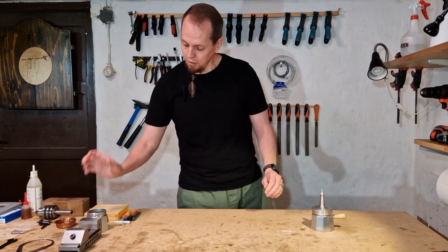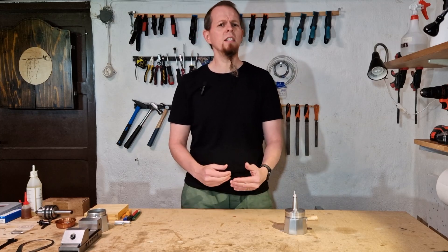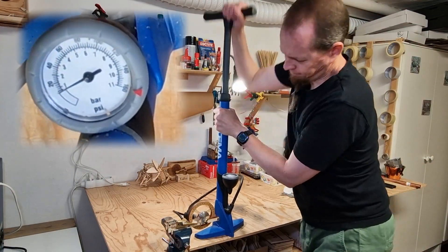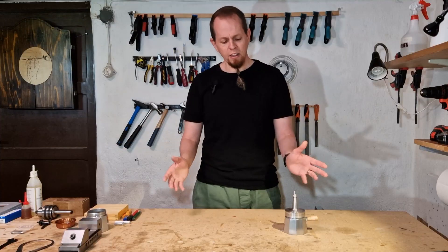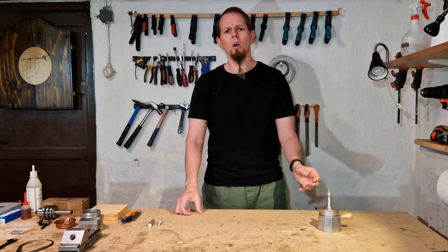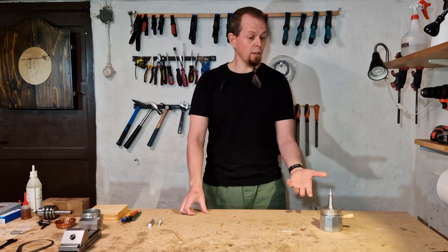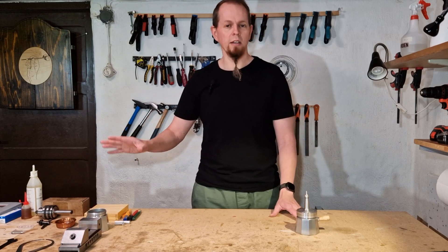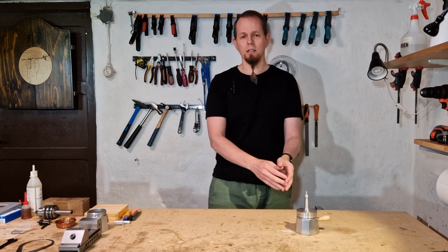So it doesn't work as intended and I cannot build up any steam pressure, so I removed the valves and added these nice handles. Personally I'm not that worried about the pot exploding in the specific setup I'm using — the oscillating engine has a release mechanism where I cannot create pressure above 2.5 bars. However, I might use these boilers in the future for a different machine where pressure could build up more, and a safety valve would be needed. Also, I'm going to give away one of these engines, and it's better to have safety valves included. I don't think it's necessary to take any small risk for something that is trivial to fix.